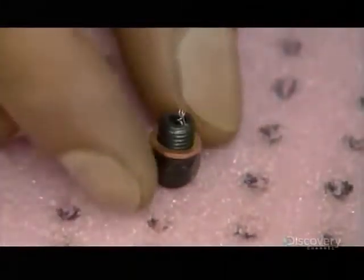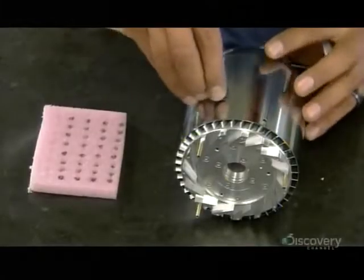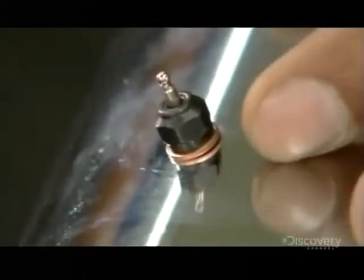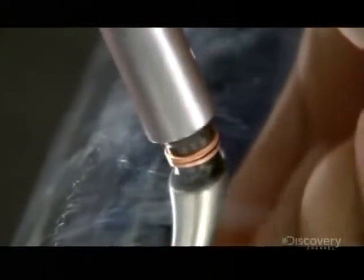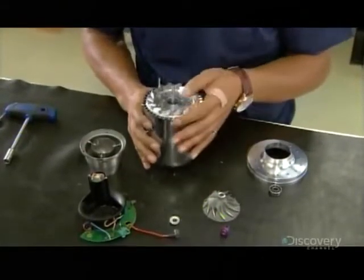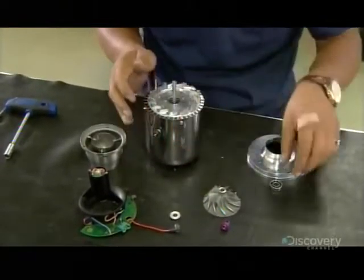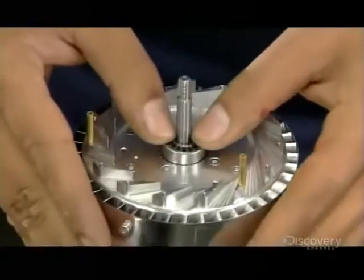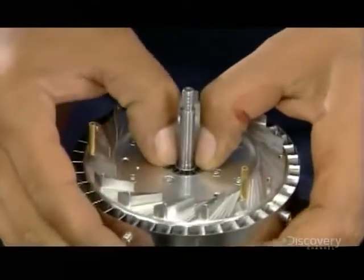And now, the glow plug, so named because it glows to ignite the fuel inside. He pops it into a threaded slot on the side of the combustion chamber, which is by now encased in an outer shell. He installs the turbine and shaft, sliding the shaft into the center cylinder. He supports the shaft on both ends with thrust bearings and washers, pressing the parts into place.